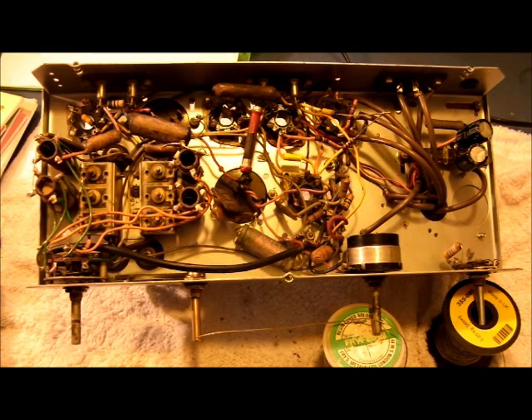I've completed reconstructing the power supply circuitry associated with the 6X5G. Part of it I had already made — remember me finding this tag strip and soldering the two smoothing capacitors, a 47 microfarad capacitor, and a 1k wire wound load resistor onto it, when I checked the strength of this radio's performance before I stripped this chassis of its components.